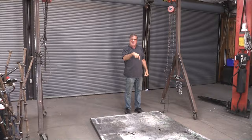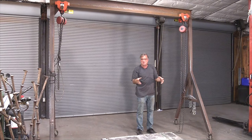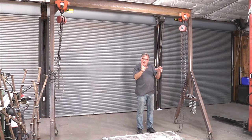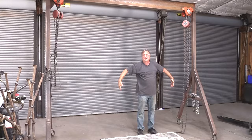It's all flat on the ground, so I can do all my work down there. Time to pick it up. This is my hydraulic lift table — it goes from the ground up to six feet tall. I still had a little higher to go, so I made some little tables and put some blocks under it. I put the table all the way to the ground, picked that I-beam up with an engine hoist, got it up as high as I could, got it blocked in place, put some tie-down straps on it so it wasn't going to move off the table, picked the table up, and let the legs just fall down into place. Set everybody back down. All done.